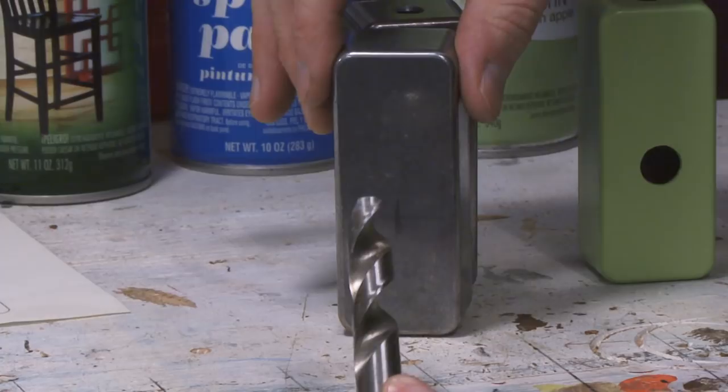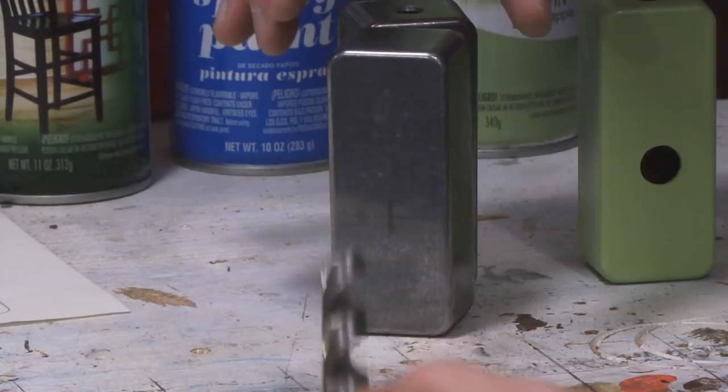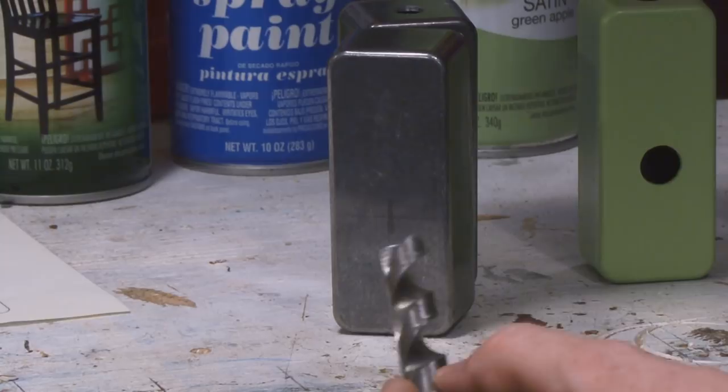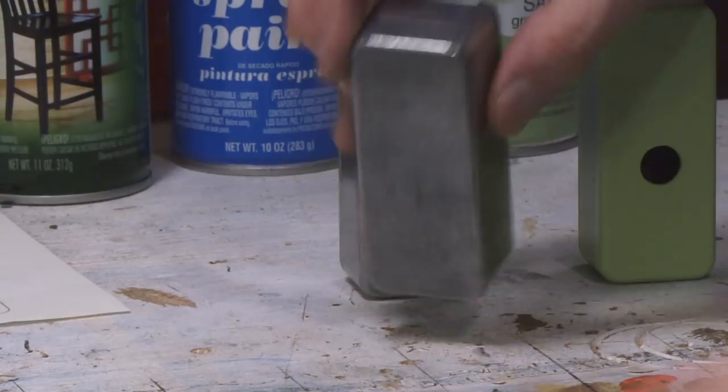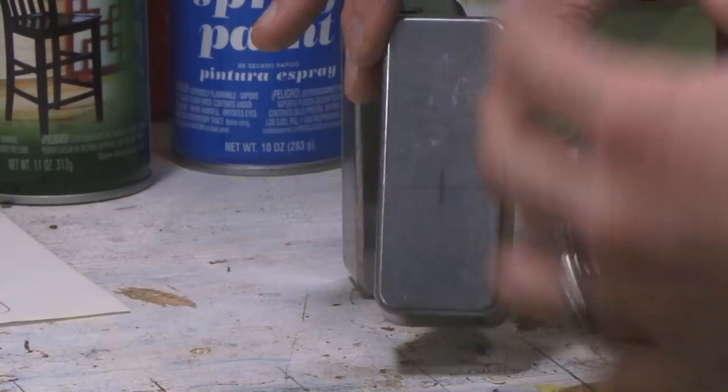Otherwise, when you start drilling it in, unless you have a drill press, it's gonna get really wobbly in there. It's kind of weird, but you're gonna create a square-ish type shape instead of a circle. Not really square, but it's gonna have some angles to it you're not gonna want. Then do the same process on the top for anything else that's being plugged in. So your in and out jacks and the knobs you're putting in there all need to be drilled out first.